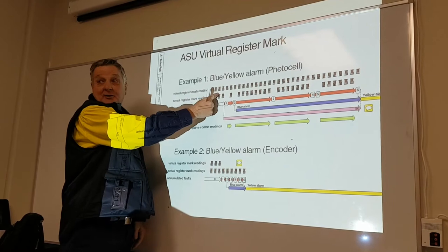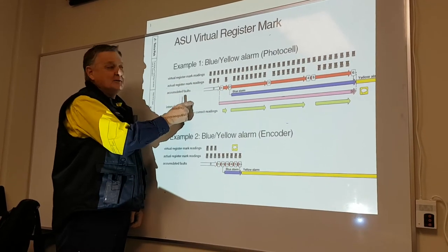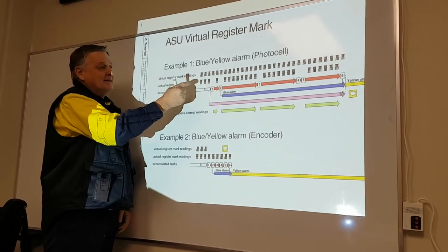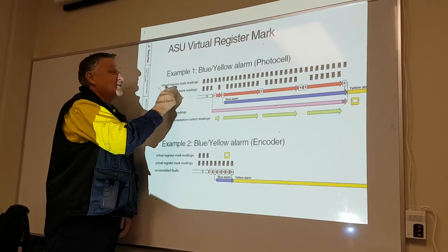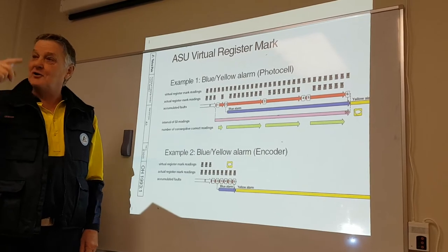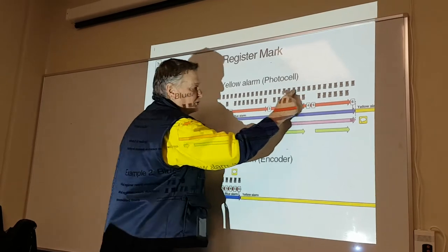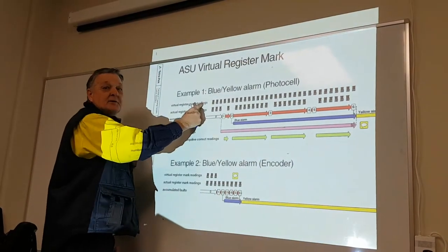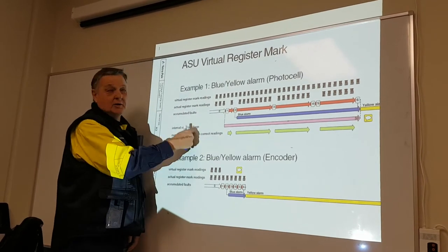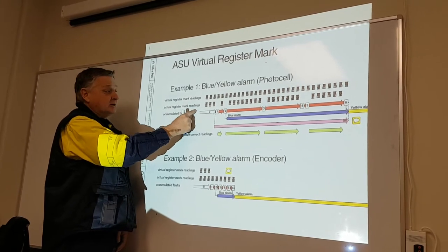Every 2,000 steps, every 439 millimeters, we have a virtual barcode. I just said that to confuse you a little bit, mate. But remember the 439 millimeters. Every 439 millimeters, virtual barcode. These are all virtual barcodes, okay? Coming from the incremental angle encoder and the roller. Actual readings of the mark are actual readings from the packing material.